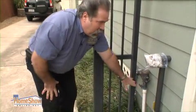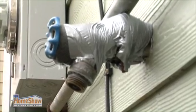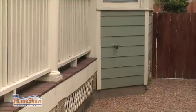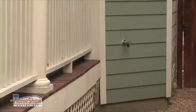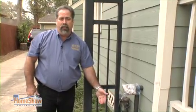We've got the exposed pipes. We want to do the same thing there. We want to go ahead and make sure we wrap it, make sure that any exposed pipes that we have everywhere in the house, make a walkthrough of the entire yard, check to see where your sprinkler system is, if you've got one of these, check your water lines coming into your house.